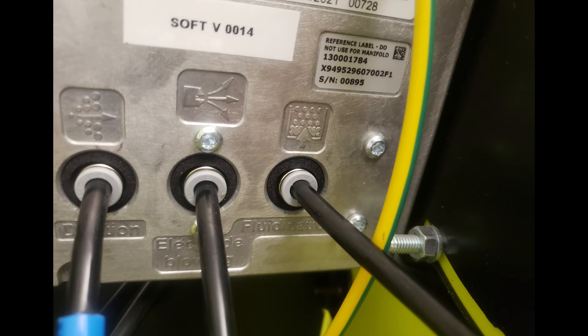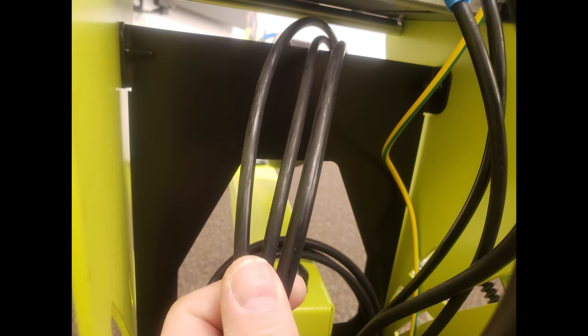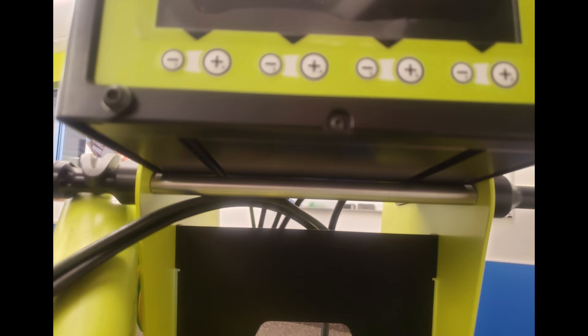This red and blue marked tubing is for connection to the powder pump. There also will be a black 6mm tube that will lead to the gun — insert it into the push lock labeled electrode blowing. The final pneumatic connection is another black hose for the fluidization of the powder. Now feed the three hoses — injection, dilution, and fluidizing — through to the front of the unit via the space under the controller.